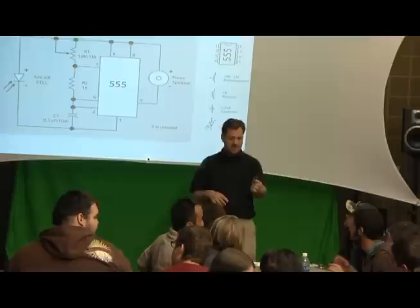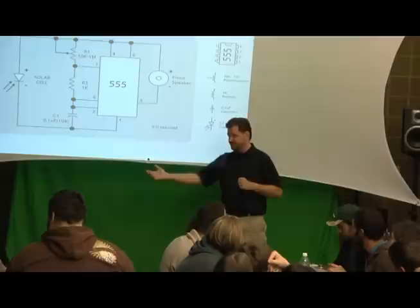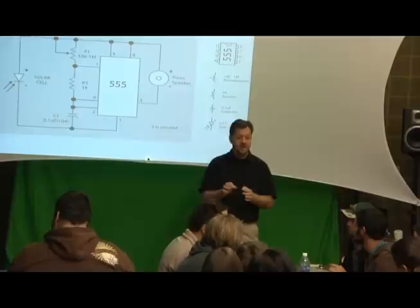Like you can see, I don't know if you guys can see these, but one leg is longer than another. And the way that I remember it is, the one leg that's longer has more, so that's plus. That's the positive side. The leg that's shorter is minus something, so it has less. And then you can actually look on that, and it has a little strip on here with arrows. Whenever they have these little arrows, that's the negative side. Okay? But now these capacitors that are getting passed around, those little orange ceramic discs, they're not polarized. The legs are the same size, so it doesn't matter.